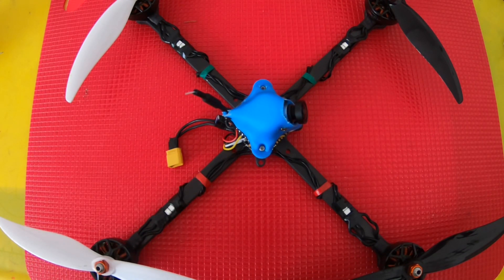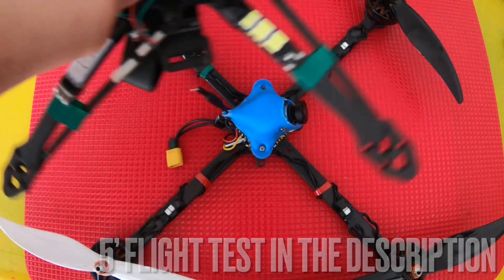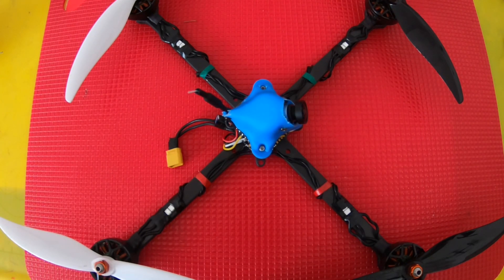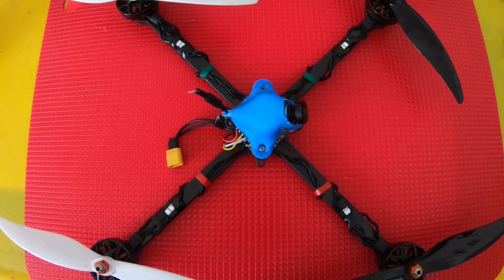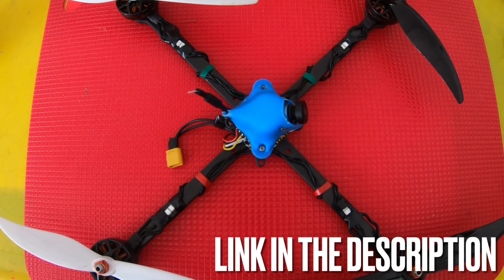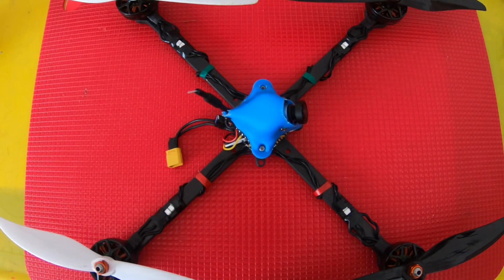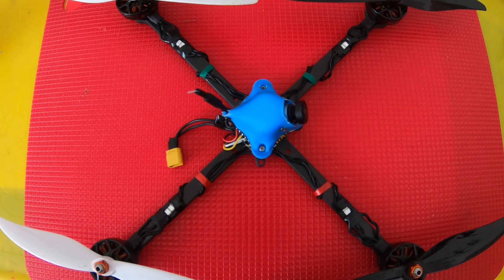Hey guys, Chris here. I took the Stan FPV motors off of my clearance quad, so I've got that cleared off and ready for some new motors — hopefully they'll be in in a couple of days. Until then, I put the Stan FPV 2604 1690 KV motors on my toothpick 7-inch quad, and we're gonna run them on the new Gemfan 7035s. These are cinematic props — I've done a special on them before and they're pretty stable. I think with these cinematic motors it's going to be a pretty good combination. This is not a GoPro-hauling drone, but a couple of subscribers asked me for a quick video with these Stan FPV motors with a 7-inch prop, so here we are.